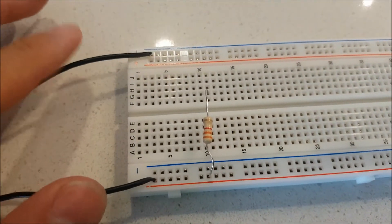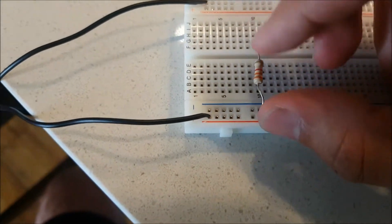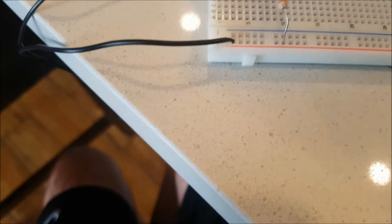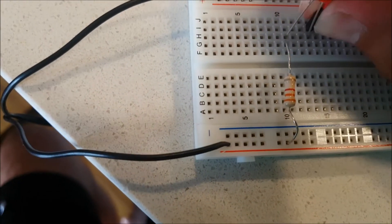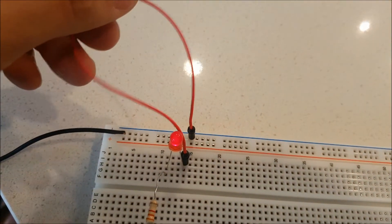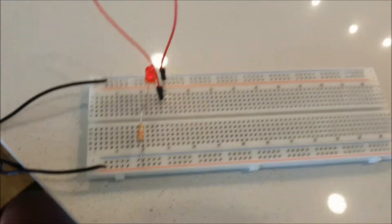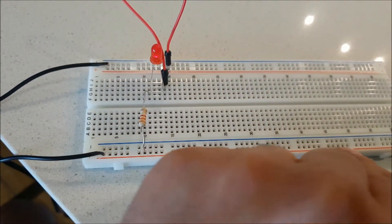Because I already have my lead from the DC power source, it doesn't matter — if I want to bring power from here to here, it doesn't matter if I plug this resistor in this hole, this hole, or this hole. It will be the same. Let's build a quick series circuit and complete the path; we have to complete the path for the electron flow. Remember, I can plug this resistor in any hole because this is connected by a metallic bar that is under those holes.